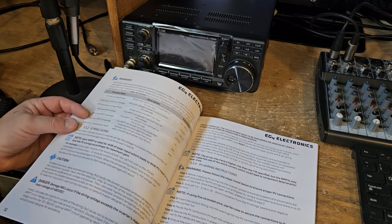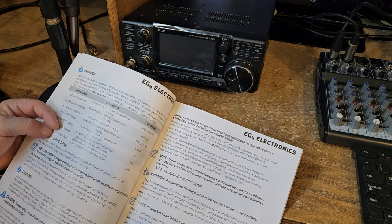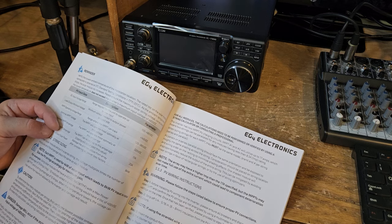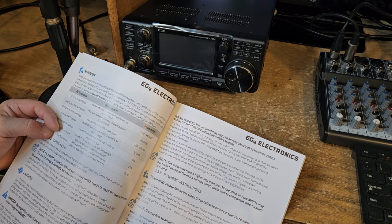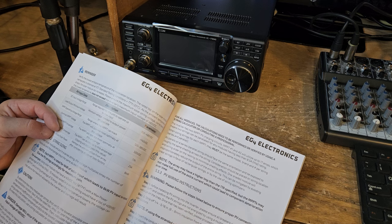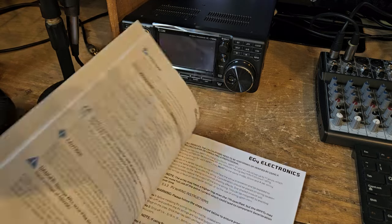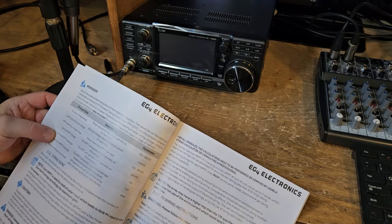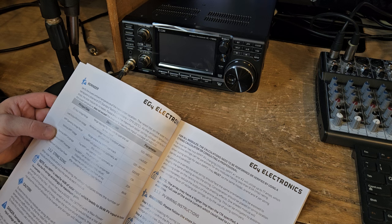Everything's going to be different because I got to re-switch the wiring, but let's see what other warnings we have. For all modules, calculations need to be verified by using a string calculator or consulting a professional. The inverter has two charge controllers, one and two, utilizing up to 17 amps. It means two strings can be paralleled for any module... What? Utilizing up to 17 amps for the whole entire thing. Ugh. Okay. Which means two strings can be paralleled for any modules having less than 8 amps rating.